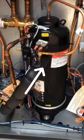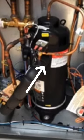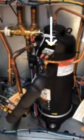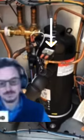So what's happening there — the click you're hearing is a solenoid, right here, you can see that. The suction gas is at a lower pressure than the discharge gas, so when this solenoid opens, it creates a low pressure on the top and the top scroll is able to release or go up. You hear a click, then a change in the compressor sound, which is the plates unmeshing, and then a change in the sound again when the plates come back together. It's very simple.